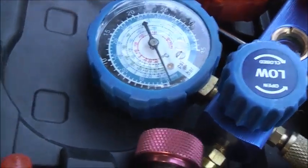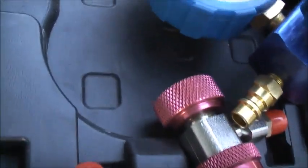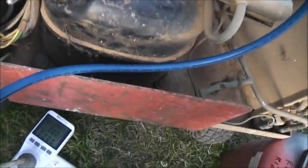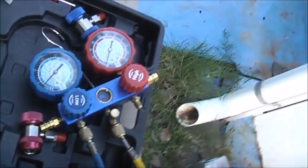Okay, viewers, I'm going to regas it. Plenty of vacuum in there, it's holding. Purge. They go in there. Tip it upside down, get some liquid in there, eh? Here's liquid going in. It's about a kilo and a half in here.